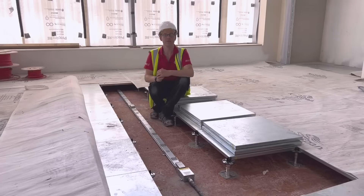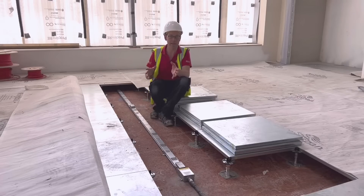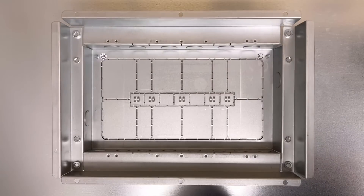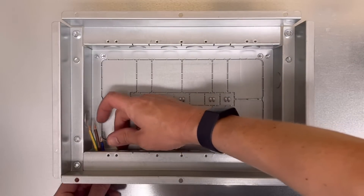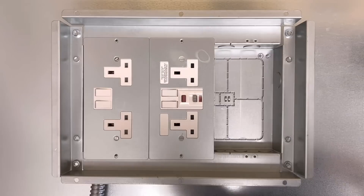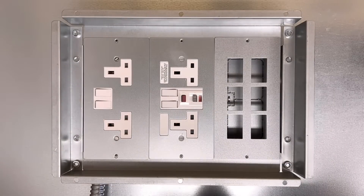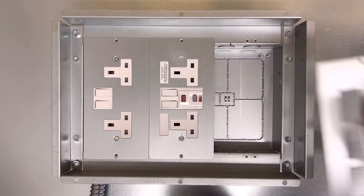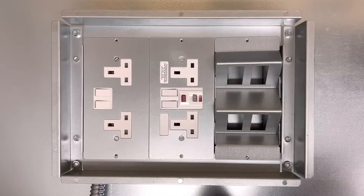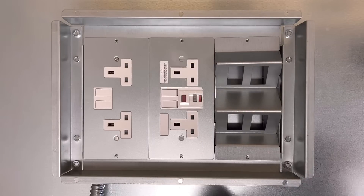When it comes to getting power and data to positions that are away from walls without trailing leads, the floor box is one excellent solution. The flexible conduit from the tap-offs can be brought directly into these, and the conductors connected to socket outlets that sit flat in the base. As well as containing socket outlets, you can also install data connections into the same outlets, either into these flat plates or these cleverly angled wave plates for easier access. These are really adaptable and allow you to install whatever configuration you might need, with both three and four compartment boxes available.